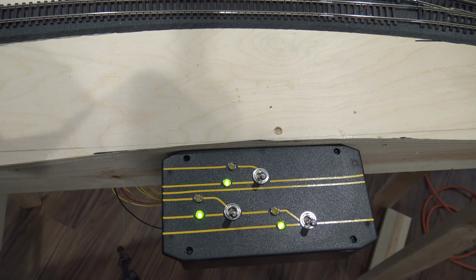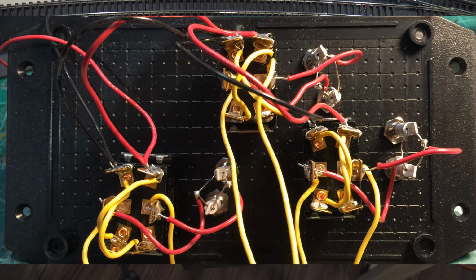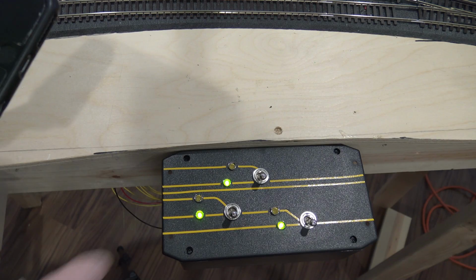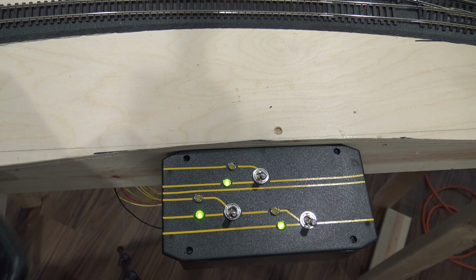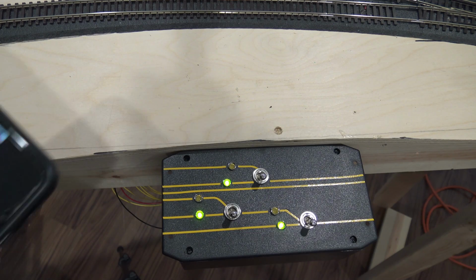But wiring it up was such a major challenge. So many wires. As you can see from the wiring inside the box, there are quite a few wires. The yellow ones are going out to the tortoise motors because they change polarity, and the black and red that leave the box over in the left-hand top corner are going to power, positive and negative. You need to keep that straight when you plug it in, to make sure that your lights are all lit correctly. You have to be pretty systematic about this to make it all come out.